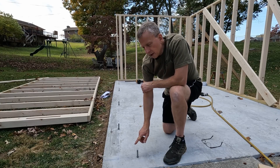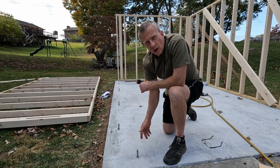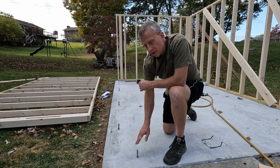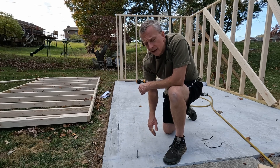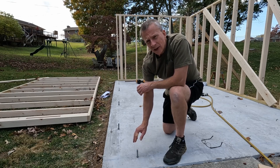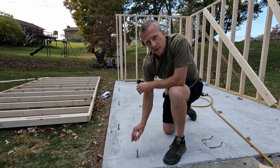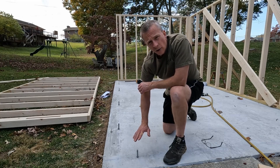Okay, as you can see now, I've gotten my studs put in. I decided to do the studs after I poured the concrete for a couple of reasons. My friend Tim and I had never done a lot of concrete, so we didn't want the anchors in our way when we were troweling and floating the pad. And it's kind of time consuming to get them placed in the exact correct place with jigs and everything while the concrete's still wet, and we didn't want to take away time from getting the concrete all flat and smooth.